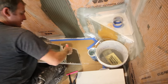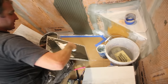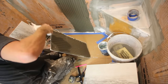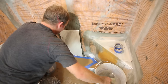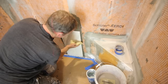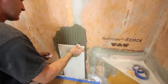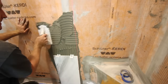On the walls, I always back trowel — I've just been used to doing it for years. It gives a little bit more flexibility on lippage. You can just back butter and leave it like that as you do a floor, but I like the extra thickness. I always have a nice sponge handy. As you saw there, Steve removed the excess thinset from the edge of the tile because we're going to be using clips for the T-Lock system. That will help prevent the thinset mortar from collecting along the edge of the clip.